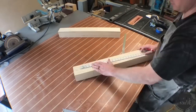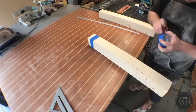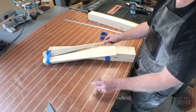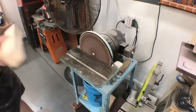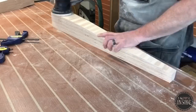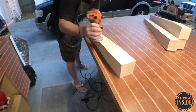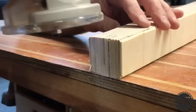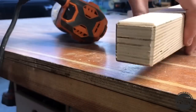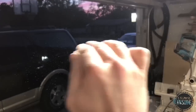The idea here is we're going to make a taper. You can do this on the table saw but I chose to do it on the band saw. You take one cut, then tape the offcut back on with blue tape, turn it 90 degrees, cut your other line, and when you take everything apart you get a nice tapered leg. I take each piece to the disc sander — you can also use a random orbit sander or do it by hand. I then take a router with a chamfer bit and ease the edges, including the bottom of the feet to prevent splitting when the table gets moved. A little light hand sanding polishes everything up nicely.